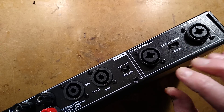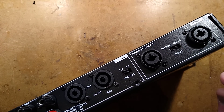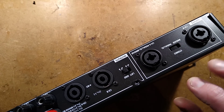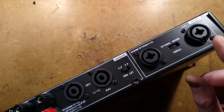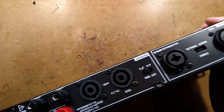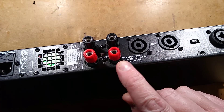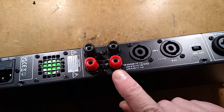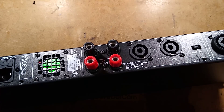When you've got it in stereo, it just treats it as two separate channels, left and right. In parallel, it only looks at one of the inputs but puts it to both channels — so basically two channels but just one mono signal. The bridge option inverts the phase of one of the waveforms and effectively means you can connect a speaker across just the positive terminals and it drives it at twice the power.